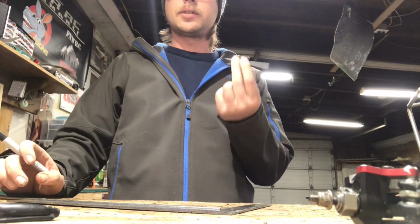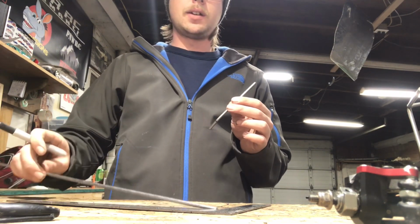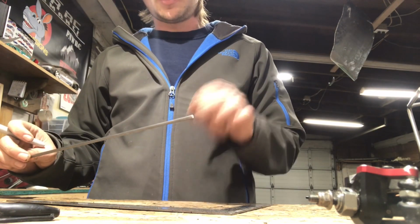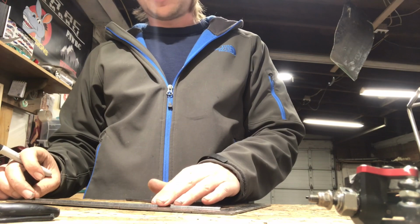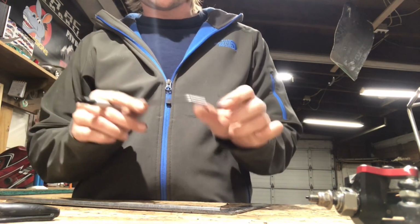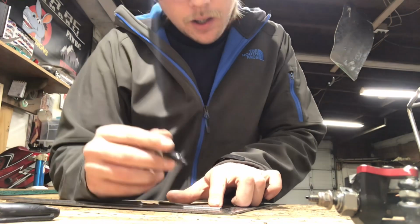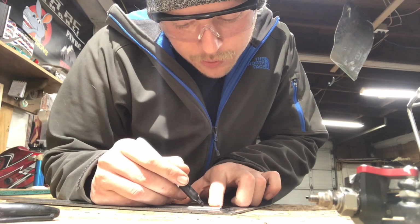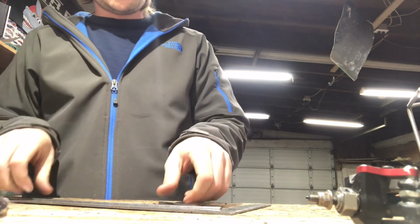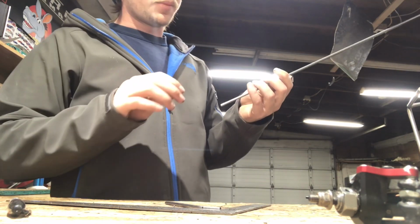Now that the roof bar is all cut out, measured, and it's fitting just fine, I need to replicate it. So I grab the bar that I want to use to replicate this bar, and I butt it up flat. And then use the side that has the mark to butt up against that. Again, going to transfer the line over. Take it to the vise. Again, same process.